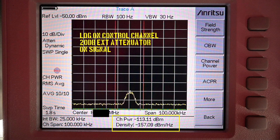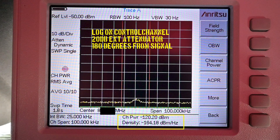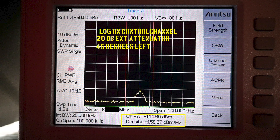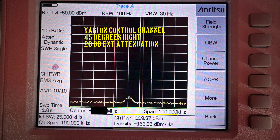Here's a display of our instrument performing testing — even with 20 dB of attenuation we still have a respectable signal. The signal is modulated, occupying more bandwidth than our earlier test. It is hard to find a constant carrier at 800 MHz that isn't simulcast here to test on. The density of the signal makes it difficult to establish directivity analysis. To properly DF this signal, we would attenuate it until only a small indication appeared on the display, giving us a good initial direction for further study.